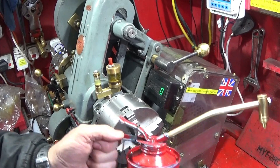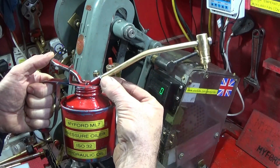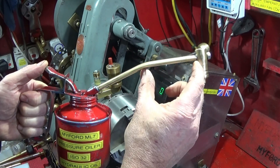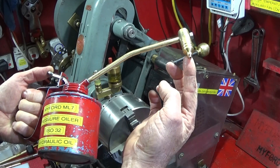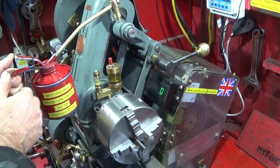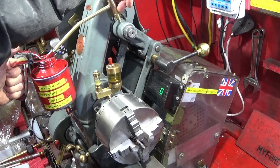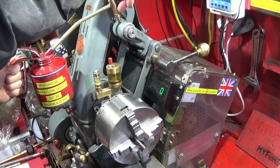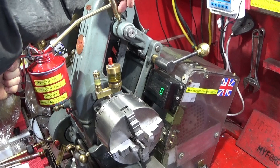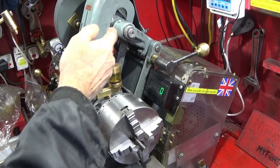Today I'd like to show you a quick tool I've made from an old oil can. I made this assembly by drilling through a piece of 5/16th brass from both ends with a long series drill, then put an end on here which suits the button oilers. I can push down quite hard with my other hand, pump the oil can, and push oil into that countershaft bearing until it drips out through the sides. That tells me it's pushed out the old oil — and it's a phosphor bronze bearing in these countershafts.